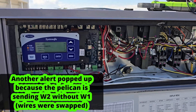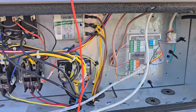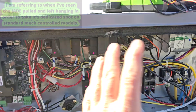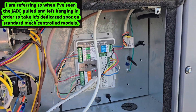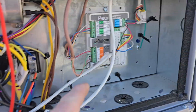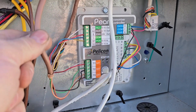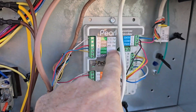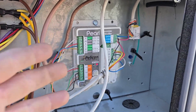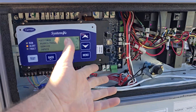We're in the setting — I know that's why I want to come out here, because you've got to get the hands-on. This stuff is like — what a shame. So we've got this, and then these people are shoehorning in these systems. At least you can see them moving stuff to fit their equipment. But they're going from here to their data, controlling the thermostat — supply air, return air, outside air, all those sensors they added with crappy wire, ready to break. These are your analog inputs and outputs for the economizer, so they can see it on the front end. But if they just knew how to use BACnet and use their board to communicate to this controller, it would bring all these points to the front end and do more than what that's doing.